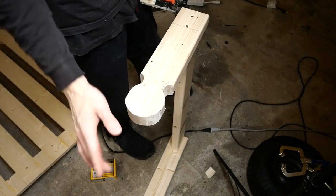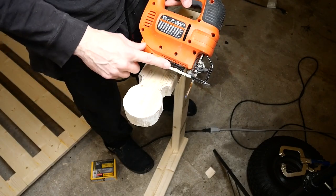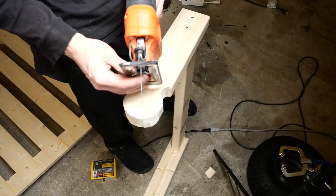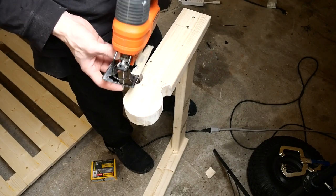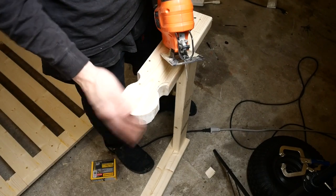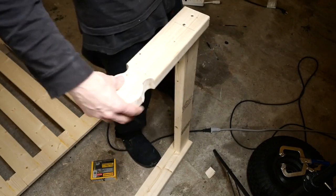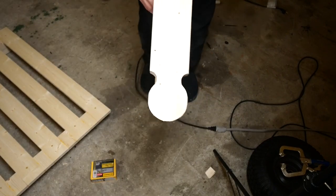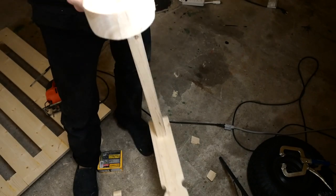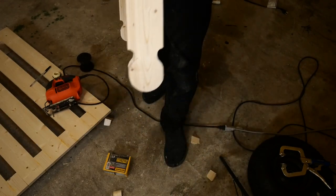That is a bad cut, but it's not bad. Anybody who's used a jigsaw knows that whenever you're cutting through thick wood it is not the ideal tool. I wish I had a scroll saw where I could get a nice straight cut. The jigsaw blade is notorious for bending when you're going around a curve. Jigsaw works awesome on thin wood, terrible on thick wood. I'm going to go with it — I can sand that smooth. I just cut my second one and that one came out actually a lot nicer. We'll sand it smooth and I think that looks kind of cool.